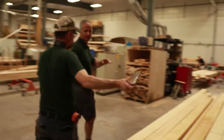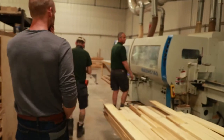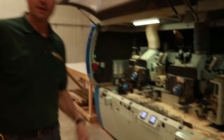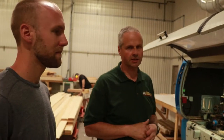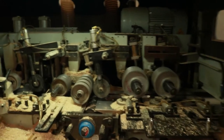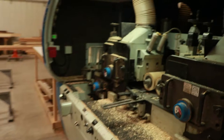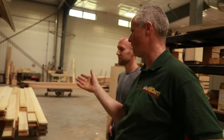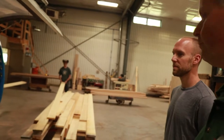I'm going to get Mark to run a piece of this through the molder in a minute, but first let me talk to you about the molder. So Casey, this is a six-head molder and it is a machine that can mill material anything from half an inch by half an inch up to 12 inches by 8 inches. We can put big Douglas fir timbers through here, we can make small shoe moldings — though we prefer one of our smaller molders for that due to the horsepower involved. Right now we are making some pine flooring, so we are going to start the machine up and we will see some rough pine going in and some nice clear red pine from the Ottawa Valley coming out. In one pass it puts the tongue and the groove on, cleans the top and the bottom, puts anti-cupping grooves on the bottom, and you end up with a nice finished product. This is a state-of-the-art machine that can run up to 100 feet a minute and produces a lot for us every day.